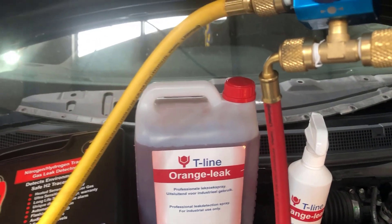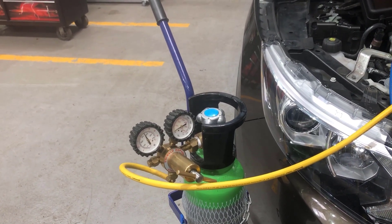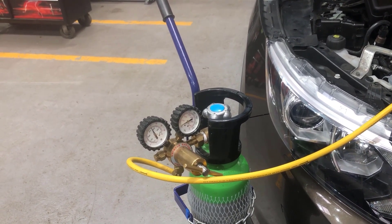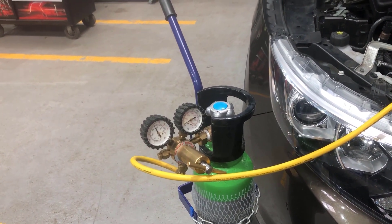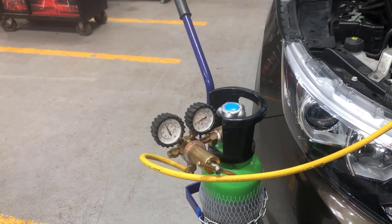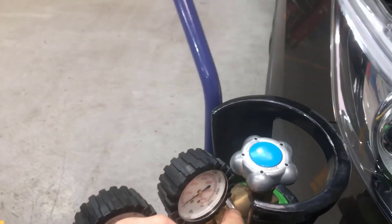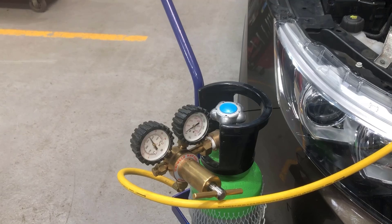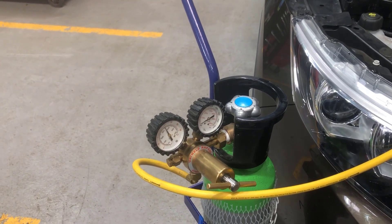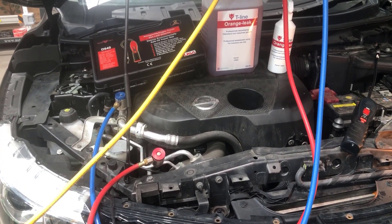For the gas, in Ireland it's currently available from two sources: BOC and Star Gas. When ordering a kit, it's important to know which supplier you'll be using, because BOC uses a BSP right-hand thread, whereas Star Gas uses the same BSP size but with a left-hand thread. We need to know this before you order.